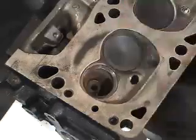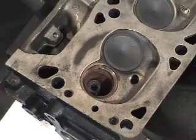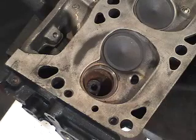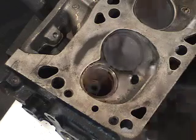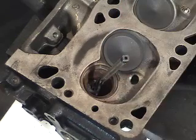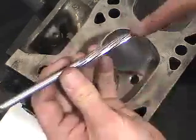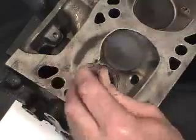So what we need to do now is select the manufacturer's minimum or maximum requirement of clearance for the valve at 312. We install a 312 reamer and it shouldn't go through the hole either. It's piloted and tapered so that it fits into the hole up to the relief areas to guide it.